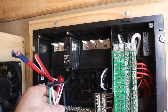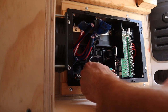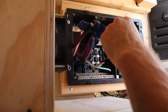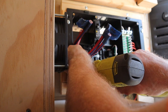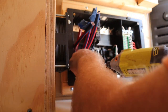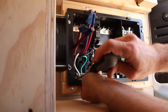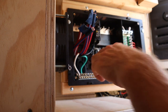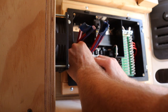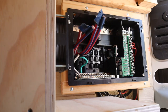My white will reach and my ground will reach, so we're good. The next thing I'm gonna do is connect my white wire and my ground wire. Towards the end I'm just kind of hand-tightening it — I don't want to stress this board out too much. However, it seems it can handle quite a bit. Just tuck your wires so that it looks neat and you're happy with it. Now I can focus on all my AC circuits.